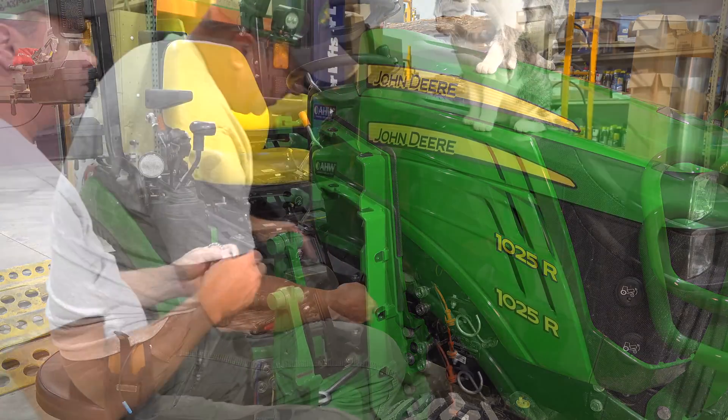These couplers work really well when they're new. Even on my one-year-old tractor, there had been so much dust built up in those couplers that they didn't work very well — I had to use pliers to pull the outside ring back on at least one of the couplers. They sometimes don't work as well when they're older. If they all worked like that going in and out, we wouldn't have any need for the single point.